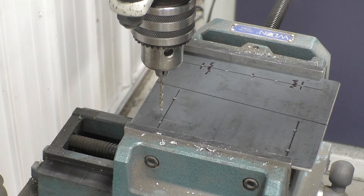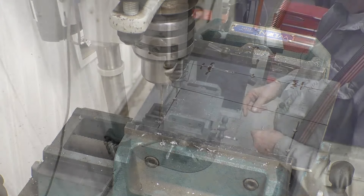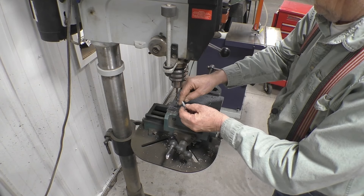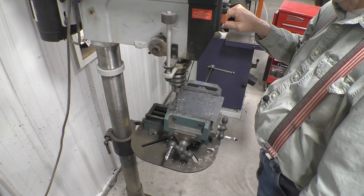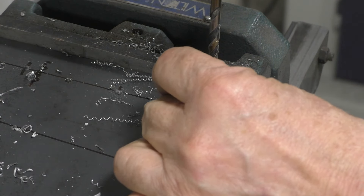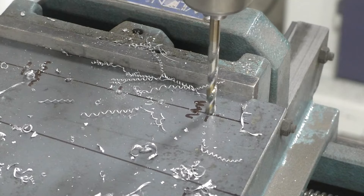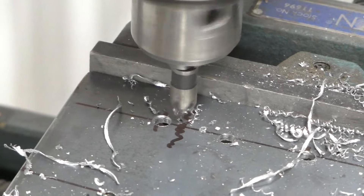With our plate clamped in place in the drill press, we'll drill some eighth-inch pilot holes. For our lag bolts to clear the plate in order to be plated to the side of the frame, we'll drill five-sixteenths-inch holes to give us the clearance for these lag bolts. We'll drill seven thirty-second-inch holes, which will give us clearance for a number-10 bolt. We'll cut these off so they're not so long, and use them for holding the relay, the ground, the relay, the ground, and the relay. And to take the rough edge off the hole, we'll put a nice little chamfer there just to ease the edge of that hole.